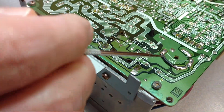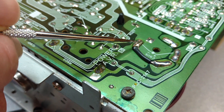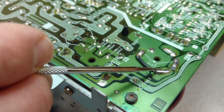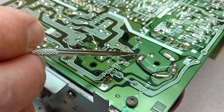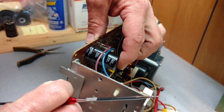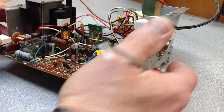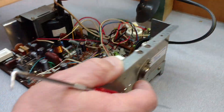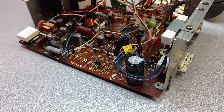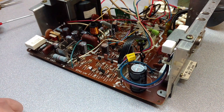Now you basically have your ground on the capacitor bridged over to the actual lead on the capacitor. So now we have the negative here and the positive here of that filter capacitor. And that's how you actually install all of these filter capacitors on arcade monitor chassis that don't have a 10-millimeter lead spacing on the chassis already.